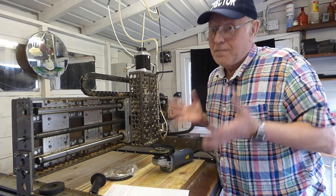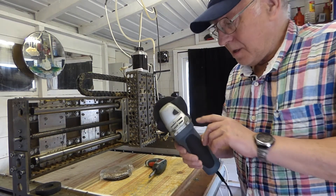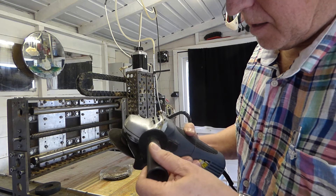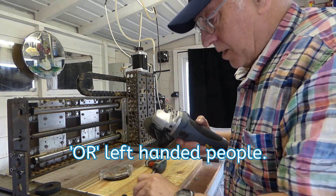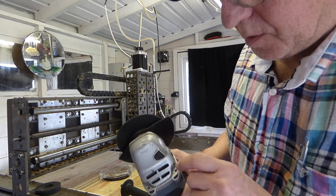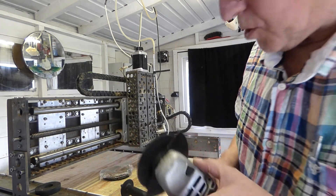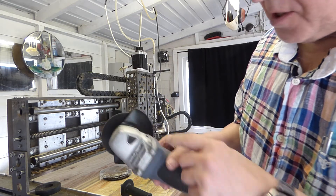Anyway, sorry if I offended anybody, but I might as well try it. On the face of it, it may look as though it's going to be very awkward to mount this on the machine. But there are two very nice M8 tapped holes here which originally are for the handle, and I can also use these two holes here which used to hold the original screws — I can use two longer screws to help attach the bracket I'm going to make.